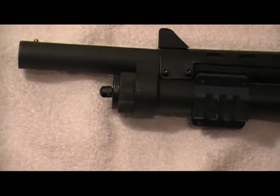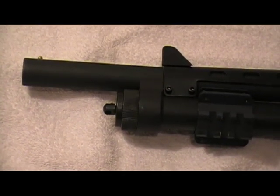So then I found a thin piece of metal that was pretty close to 0.920. It was a steel washer, and it was real close to 0.920, just a few thousandths over. So I polished the edge of that up with a sanding wheel, and then I used that as my form, basically. Then I cut out a piece from a DVD box, the case that your DVDs come in, the black plastic.